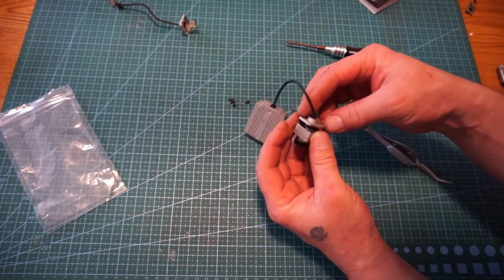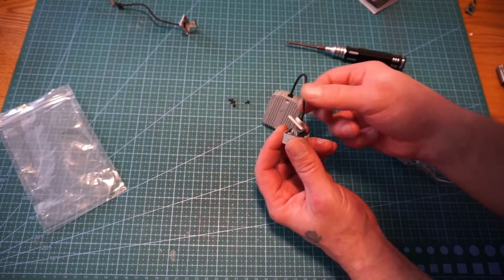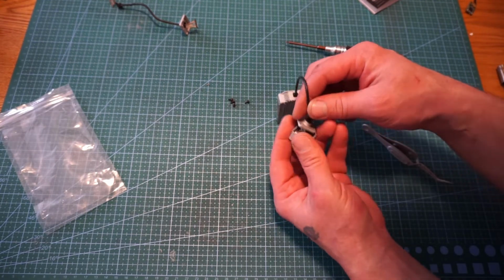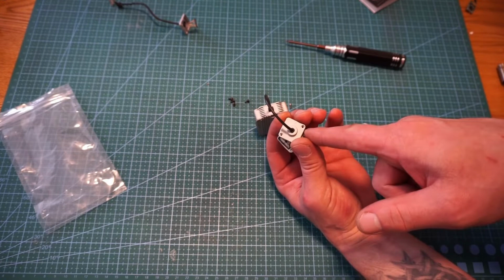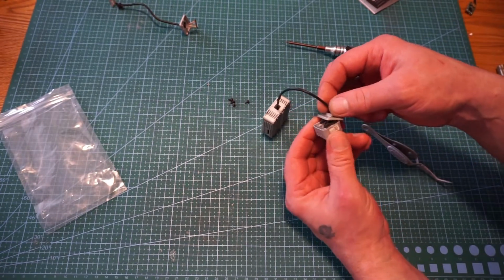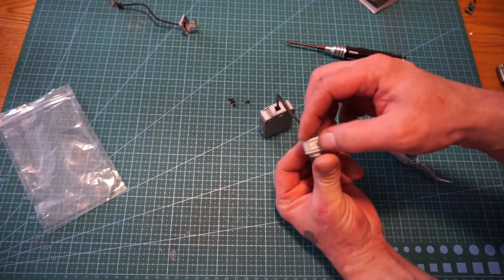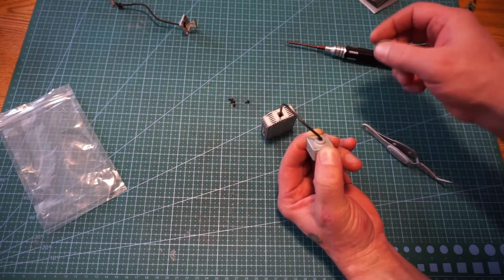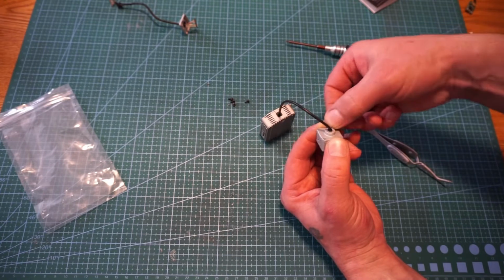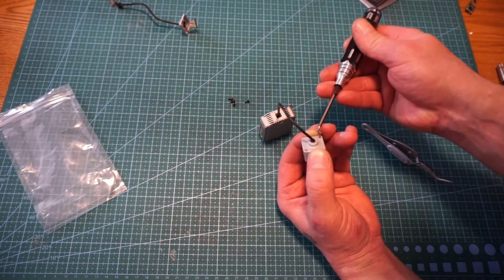Alright, so we have that. Double check it. Pretty sure the wire harness, yeah, this is on the bottom, so make sure to reorient. You have your arrow pointed in the right direction, otherwise that'll lead to a lot of pain too. If you happen to leave your barcode on, that's a good reference, or just mark it real quick before you take this apart if that's off. That way you're double sure on what is what and where.